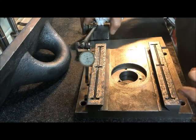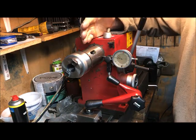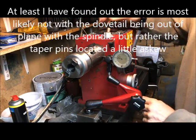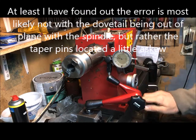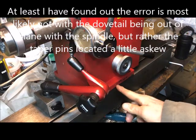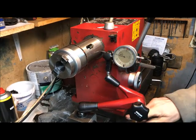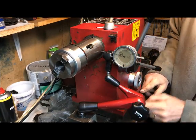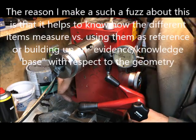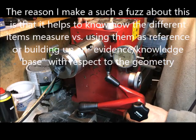Many ways to do that, but at least that's one way. And to measure the side of the spindle, I could have — now that I know that the error is in the head alignment here, I need to address this with the alignment pin there — two pins in there. And then I could have measured, if I knew this was parallel to the ways here, but unfortunately this side was not. So I then did a measurement on the other side, which I could have used, and I've done that just to verify also.